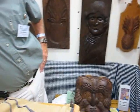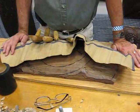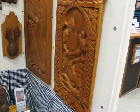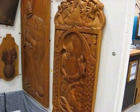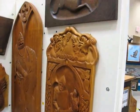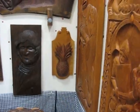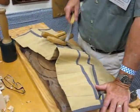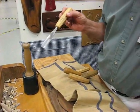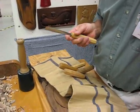My preference in relief carving is to use gouges. I do not use power tools because what I strive for is a good, clean edge. With a gouge, you can actually cut the fibers of the wood, whereas power tools, although desirable in some types of carving, would tend to tear the wood fibers and not give a good, clean finish. So for that reason, I use high-quality gouges — these happen to be Swiss-made gouges from Woodcraft Supply Company. They take an edge very nicely, and of course you want to keep them sharp at all times.